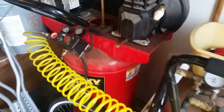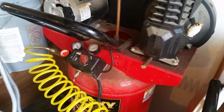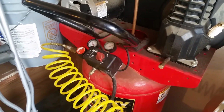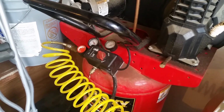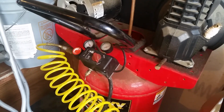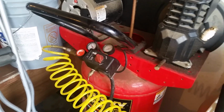Just because, you know, I could send 90 pounds through my sprinkler system, but I don't think all the parts are rated for that, and I might break something. So I was dialing it down to, I was trying for 50, because it'll still blow the water out at 50. You don't need to get 100% of the water out, you just need to get enough out so if it did freeze, it doesn't split or crack anything.